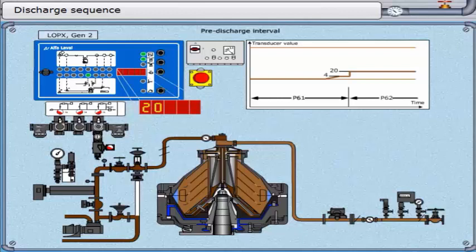If there had not been a change in the trigger level since the last reference was stored, then its value would be 0, which when multiplied by 5 is still 0. Say there had been a small change — for example, to a value of 4 — multiplying by 5, the trigger level display would then show 20. Remember that if at any time the trigger level reaches 100%, a discharge is initiated and bowl opening water is applied. Say there had been a larger change with the display showing 20: when multiplied by 5, the trigger level would be at 100 and the discharge takes place immediately.